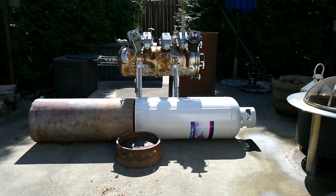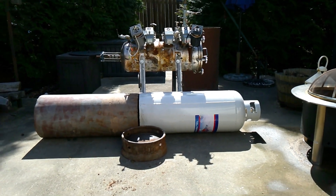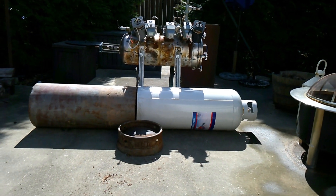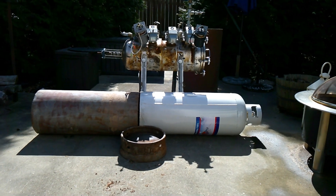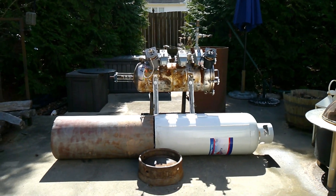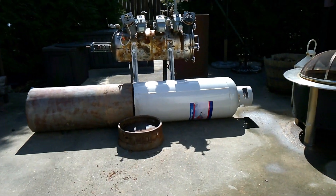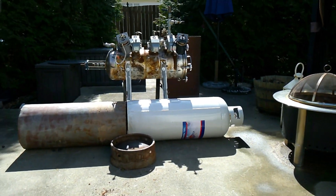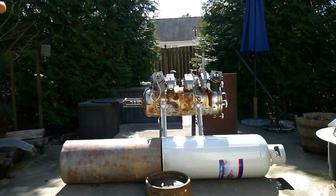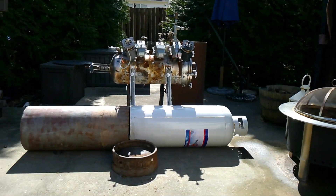You guys remember when I built Mark IV last year — we did make Mark III out of a 55-gallon drum, but it was wide and big with a big mouth. Look at that — it literally makes Mark IV look like a baby. That's crazy. But that's what we said we needed, because we needed it to be continuous. The only way to do that is to have it long enough so we can put the plastic in on this end, the blades take it all the way down, and by the time it reaches the other end it's completely carbon. Absolutely crazy — that's how big this is.